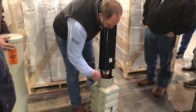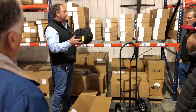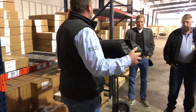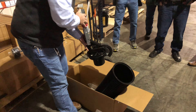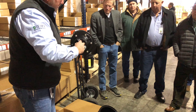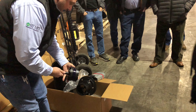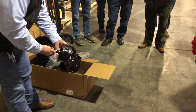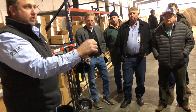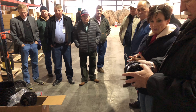If you look here at the front, there's a line right there — it's buried to that point. This is sealed and you can direct bury this. This is for a splice and tap only; this is not for bringing a tap to the home. That'll give you an idea of what you're looking at. This thing will pretty much come completely apart. You bring your cables up in here — there's a big sealing. You've got that cable running up through this gel, and as you tighten this up it squeezes these two together and seals it around that cable, making it a total and complete tight seal. Pass that around — you stick your finger in that gel and it feels really, really weird.